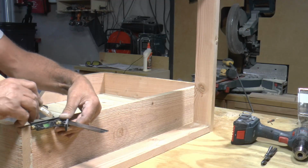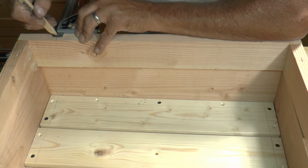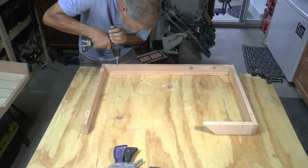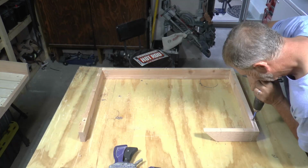To mark the depth of each hole, measure 1 inch down on your drill bit and wrap some masking tape around the bit. Going in straight is really important with this step. They do make bit guides to help with this. Unfortunately, I don't have one. If I can find a good one, I'll link it in the description below.